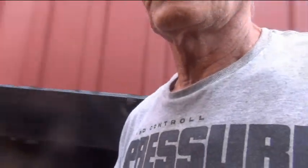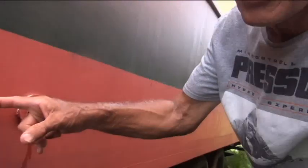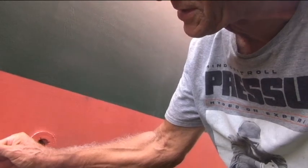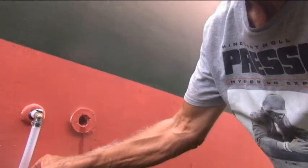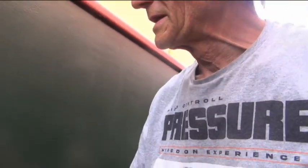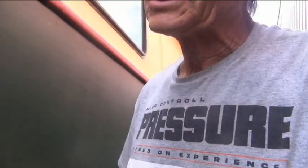There was only one through-hull I was going to use for intake, and that was to use the lake water for the galley, for washing and so on. You can see this is quite a ways above the waterline, so I had to put this little doodad on there to reach down below the waterline. It works, and you can see the water's running out here from the sink. So, waterline — that's one thing I'd change.